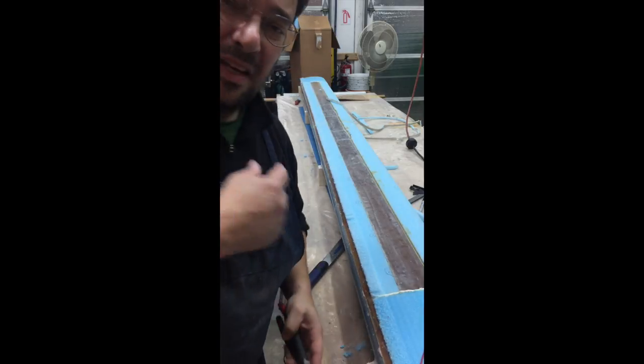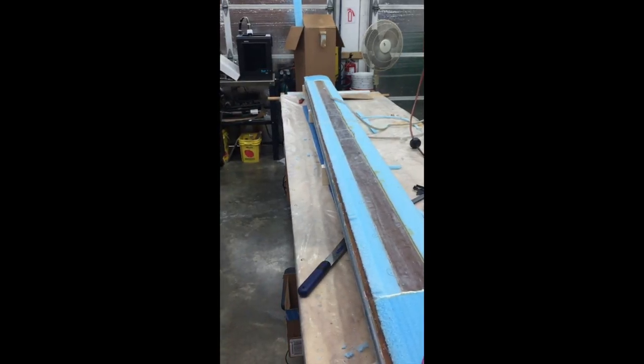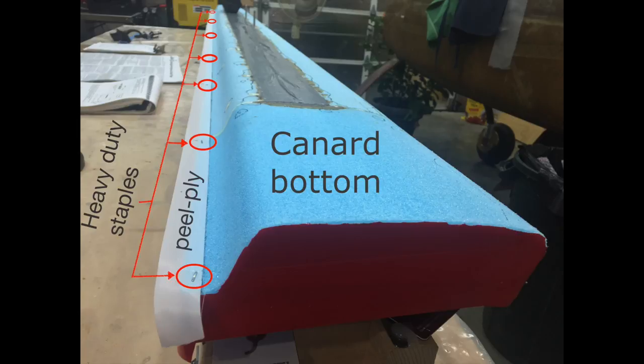Got a little blood sacrifice. Let me get you a little closer and see what's going on. I think I need to explain this a little bit better. You can see the canard is upside down in this shot — I have not fiberglassed the canard bottom yet. In this shot you can see the peel ply and the heavy-duty staples that are holding the peel ply onto the trailing edge of the canard. After this shot was taken, I fiberglassed the bottom of the canard. What we're trying to do now is rip the peel ply and the staples. Once you flip the canard over, you'll notice the peel ply and the staples are below the foam, and underneath the staples there's the fiberglass that is basically the canard bottom.